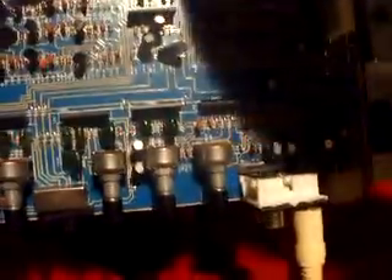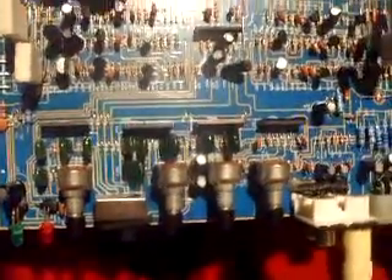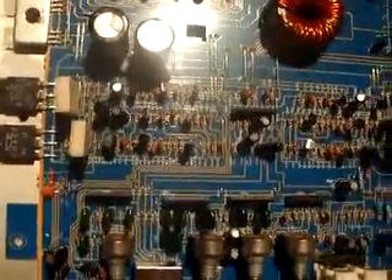When I did take it apart, I noticed I was getting one channel on this side. Doing a simple basic test with my digital voltmeter, I had determined that one of the — I think it was the PNP transistor — was bad. And what was funny is when I took the bad one out and was running with just one on this side, the unit was actually playing, but it sounded like crap. So I went ahead and stuck these in here. I'm new to repairing amps, I'm not a professional, but I got a little bit of understanding, basically doing a lot of research and hands-on experiments, blowing stuff up.